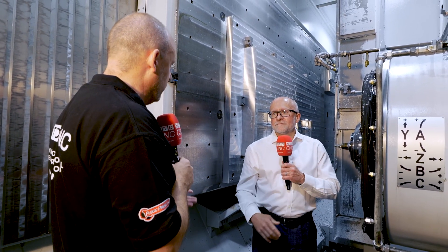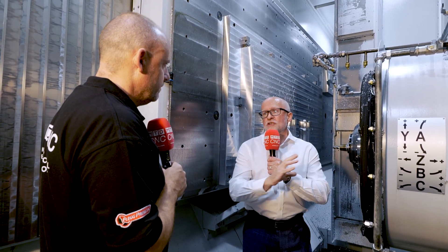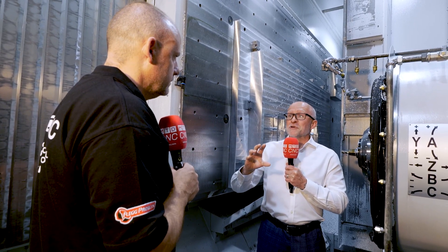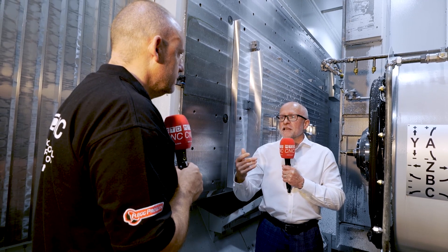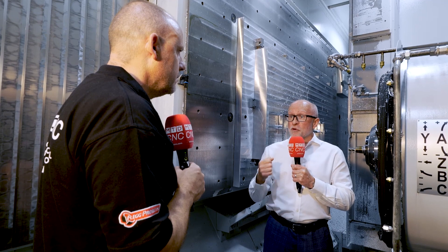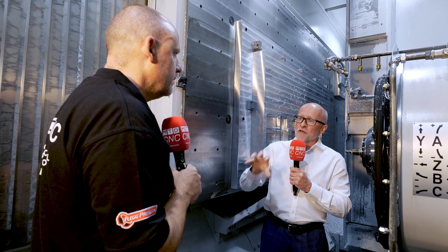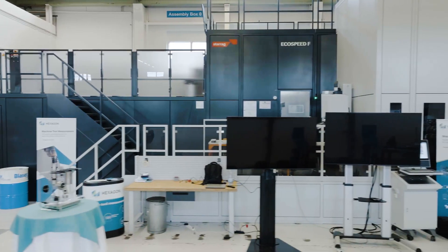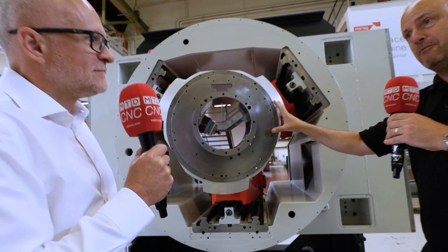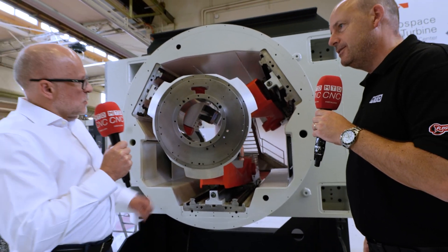There's a big difference between this configuration and most five-axis machines that use two rotary axes. One rotary axis is always the slowest part of a five-axis simultaneous move, whereas here with three linear axes — which we'll show you in a second — you've got 1g acceleration, giving your tool extremely fast agility and rigidity. Now we can actually see here the spindle and how it's made — as an engineer, this is the fascinating part. Just tell us about the construction and how it all works.